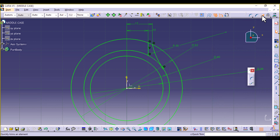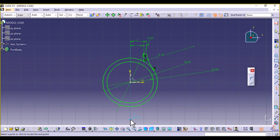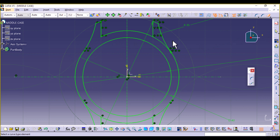Using Quick Trim, trim off the extra circle. Now select these three new elements and mirror them. First create a vertical axis and another horizontal axis. Reselect those three new elements and mirror using the vertical axis, then select all six of them and mirror using the horizontal axis. That's the profile. Now trim off the extra curve here because this is a monoblock and we don't want intersecting geometry — just click where you want to trim.